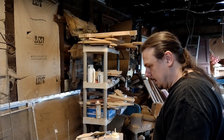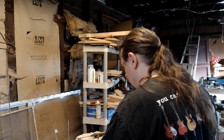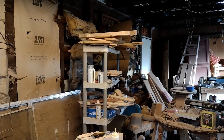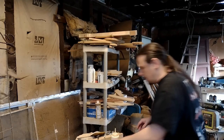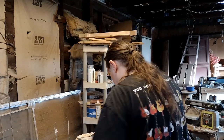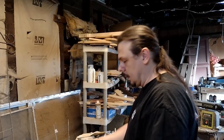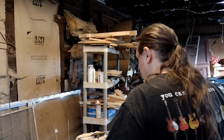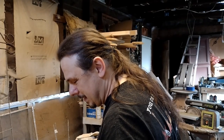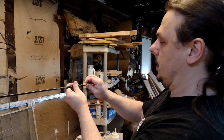We are almost at the point of having the neck ready to glue up. I want to put the truss rod channel in now. Let's get out the veining bit and two cove bits — we'll need a quarter-inch cove and a three-eighths-inch cove to accommodate for the truss rod. You can see that this lines up very nicely here, and this one for that portion as well. Razor blades are another very good friend of the guitar builder.